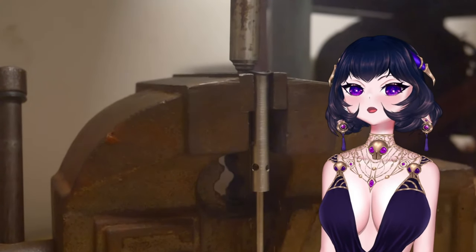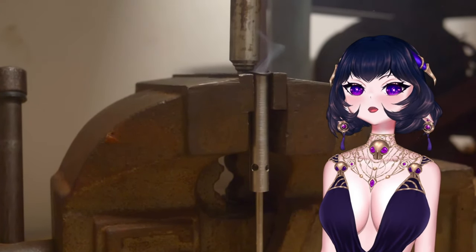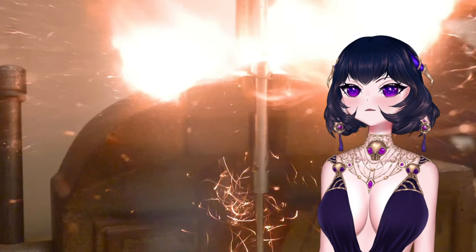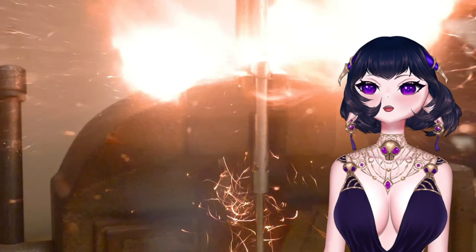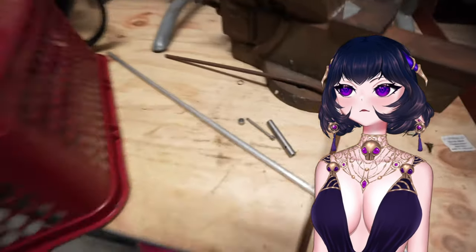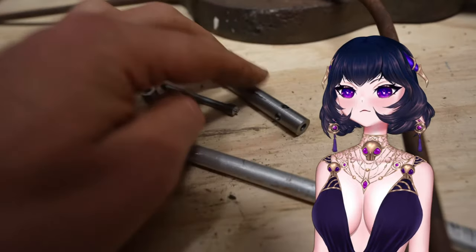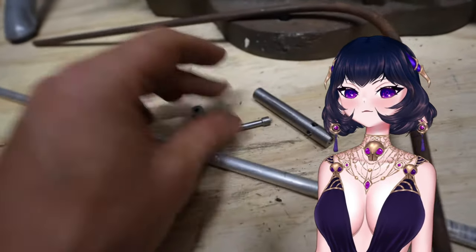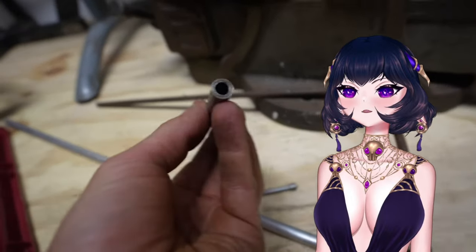And it also didn't blow up, which is amazing, as I didn't expect these holes to be big enough to let the gas out. But after looking at the slow motion, which only captured a single frame of the round going off, you can see that heaps of gas came back out the top, ejecting the round. Which sounds like a good thing, but when it's on the end of the pool stick, this means it will shoot off the end or just blow up. It also means I'm wasting heaps of gas, which could be pushing down the piston with more force.